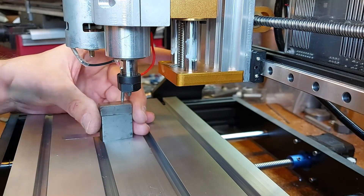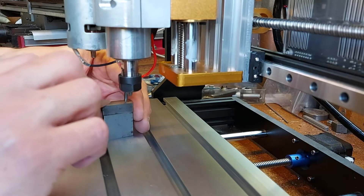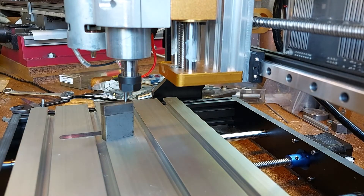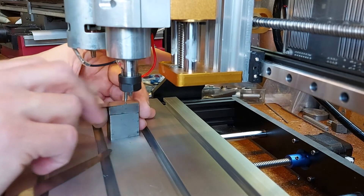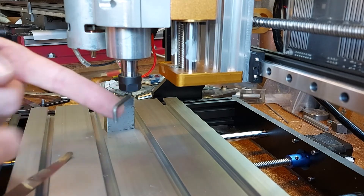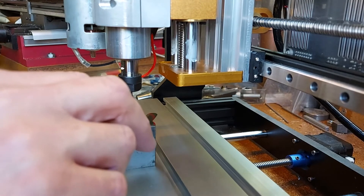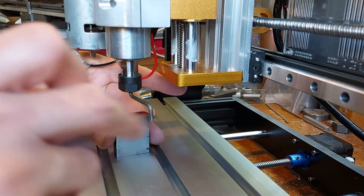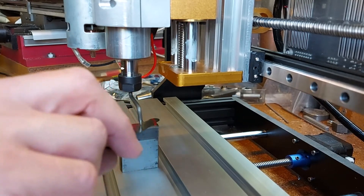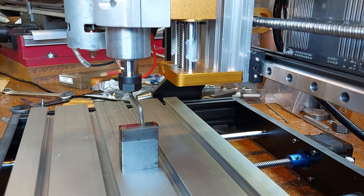But if I then go side to side, I can repeat this measurement to the other side. I can't get the feeler gauge under that — it's right up, you can hear it just on there. So again, that's a two thou — just under there. Four thou has quite a bit of tension. Then I swing the arm to this side and now I can see whether the head is upright. That's pretty close actually. There's a little bit more tension on that side than this side with a four thou, but I can't get the two thou under. So I've got probably half a thou difference between one side to the other. That's pretty good.